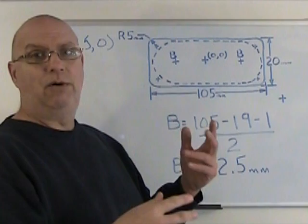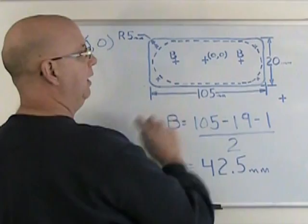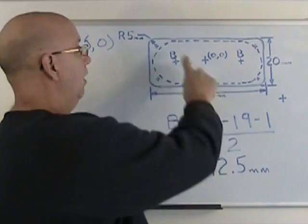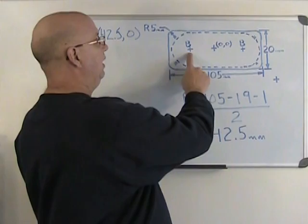I've drawn it because I wanted to make it quite clear that I do not want to touch my finished surfaces with this 19 millimeter tool. So we're going to leave about 0.5 millimeter on each side, and I also want to leave 0.5 millimeter on each end. For that, we'll calculate our positions for our end coordinates of this milling cut as follows. B, because I'm calling the coordinates for my roughing pass coordinates B, so B is going to be equal to